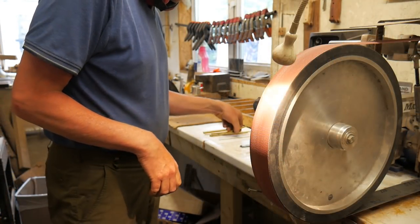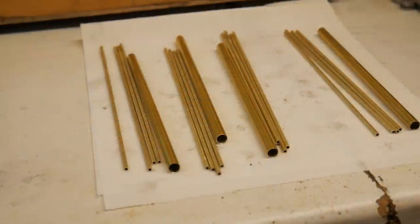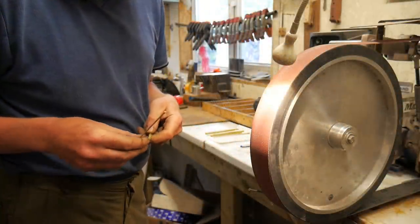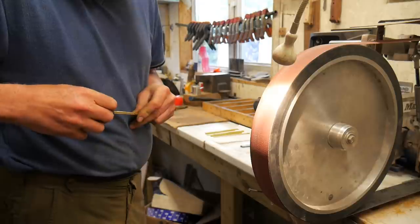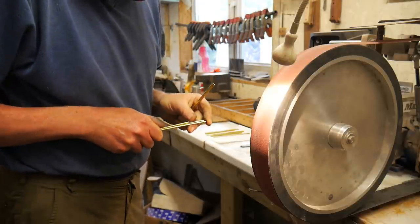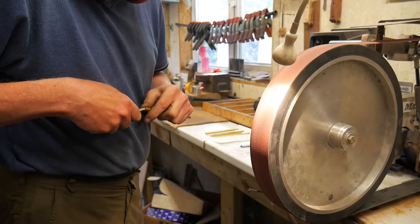That's the pins all deburred now, and I need to just wipe down all the internals with acetone, assemble the pins, and then use the compressed air line to blow out any debris, and then it's a matter of introducing the epoxy. So that's the next stage.